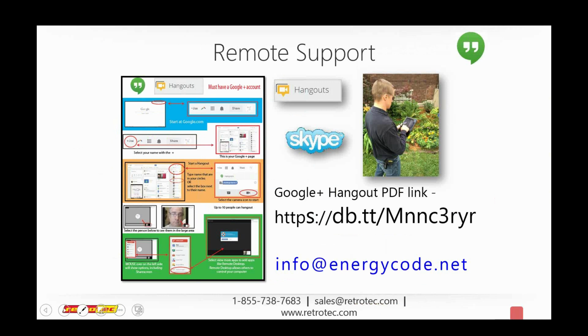We have another question about what's the maximum area that you can measure with a fan. And of course, that's with the fan running wide open, and our fans run around 5,500 CFM, that kind of thing. Let's just call it 5,000 CFM for the sake of argument. So a really easy equation to remember is that CFM is equal to the square root of the pressure that's being created times the area of the hole in square inches. So if we're establishing a 25 Pascal pressure on a 1,000 square inch hole, that's 5,000 CFM. So you take 25, you ask yourself, what times what equals 25? 5 times 5 equals 25. Square root of 25 is 5. 5 times a 1,000 square inch hole size is around 5,000 CFM. It's a little bit more, about 7% more than that.